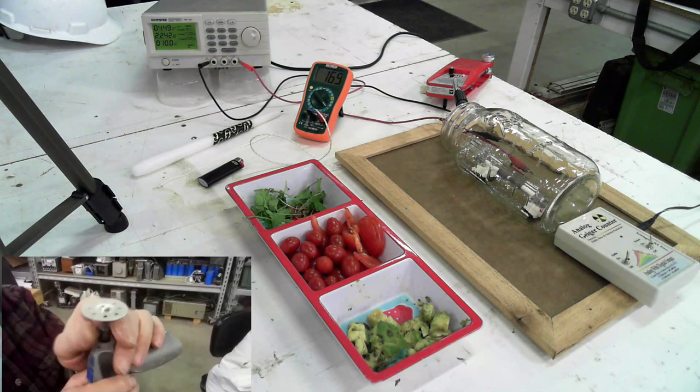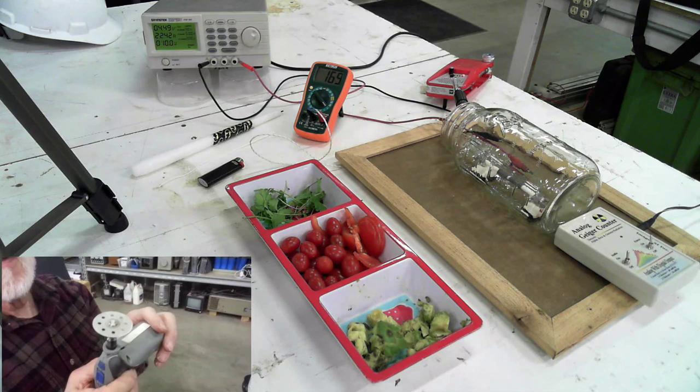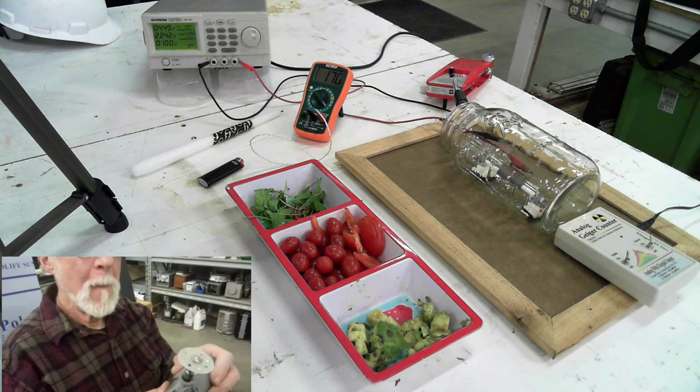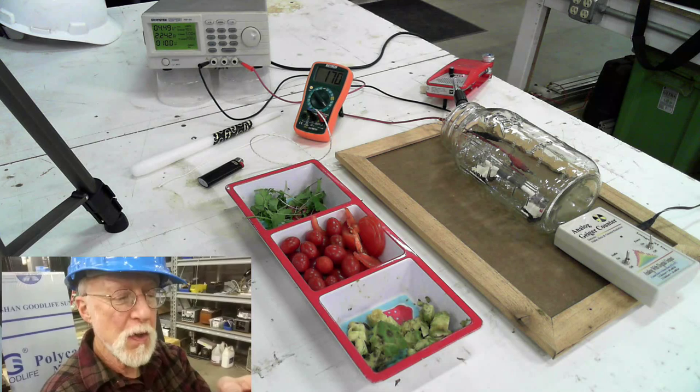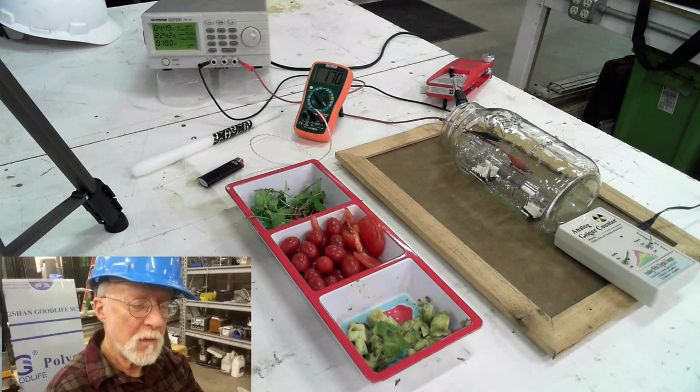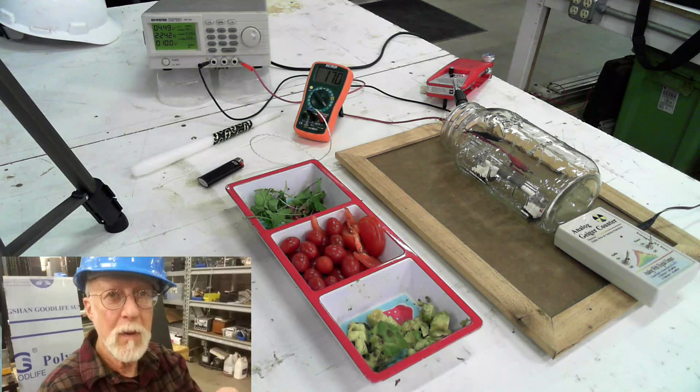And we also have a wonderful tool here. It's a diamond-faced sharpening grinder for tungsten carbide, silicon carbide lathe tools that's over in the other end of the building. And so after I cut these tubes, I'm able to face the ends of them off to make them nice and smooth again. Because as you cut with this, the last little bit wants to fracture, and you're left with a little piece sticking out of the tube. So all of these pieces, I just cut them with this and face them off on the diamond sharpening stone.